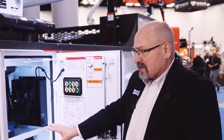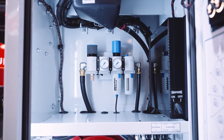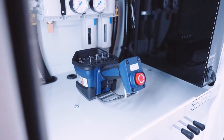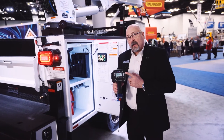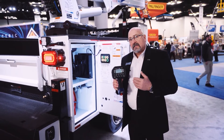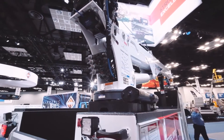This compartment is actually tied into what we call our torsion box understructure, which takes the forces from the crane, puts them into the bottom of the outrigger tube, and right into the ground. In this particular model we actually have a new control called CDT Pro, and basically what it allows the user to do is figure out how much weight he's able to pick without even taking the crane out of the saddle from a stowed position.